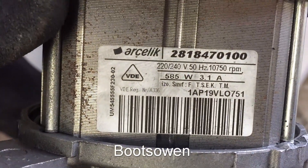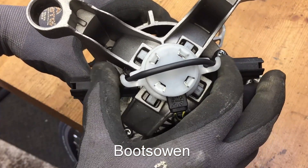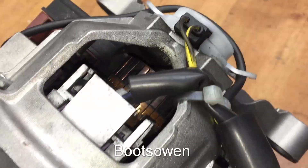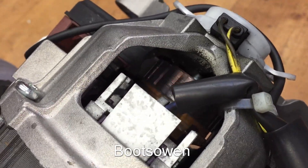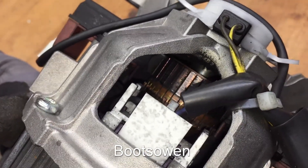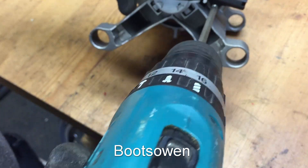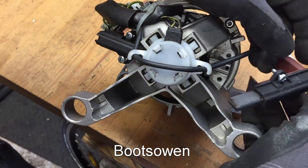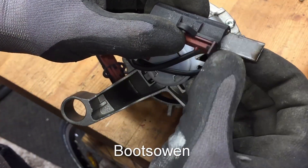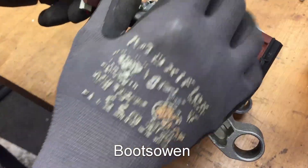That's the motor name and number. So looking at the end of the motor, these two black things here are the brush holders for the commutator brushes. And in here, this copper thing is the commutator ring. You can see one brush touching off that ring. When this is spinning in the machine it makes a lot more noise. I've checked the brushes previously and they're okay. They show browning which I think is from arcing and sparking on the commutator ring, so tidying up that commutator ring could only help.